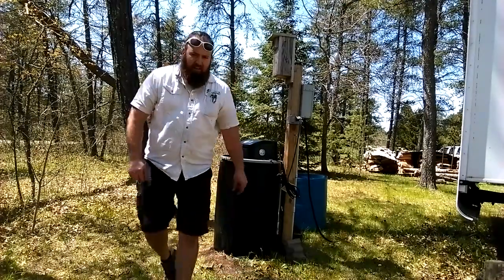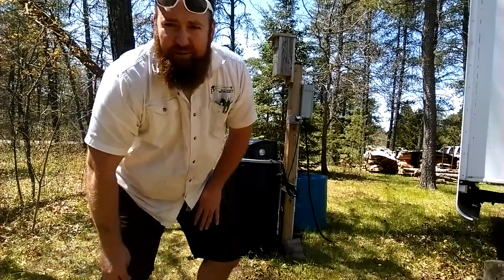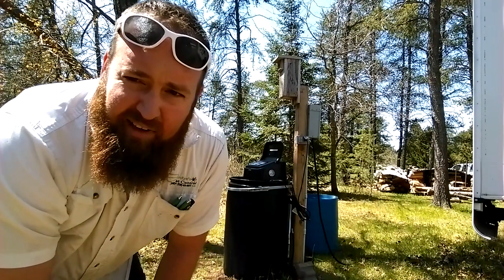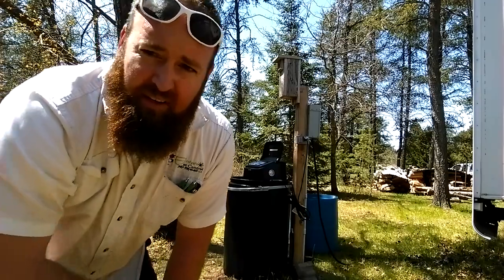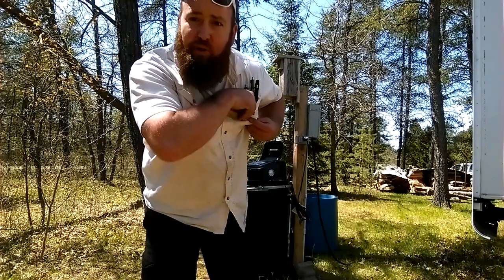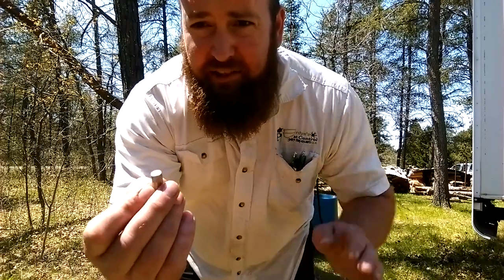Alright, we should be all set. I'm gonna go ahead and visually walk the heads, make sure nothing's broken. I've got to put a couple heads back on, and then I'll come back and fire this thing up. We've got everything set up — all the heads are back on and we're gonna run a program cycle. It'll run for five minutes and allow me to go around and inspect everything. One head is squirting like a geyser, so I'm putting the mist head on — it screws into the end and makes it mist instead of shooting a stream.